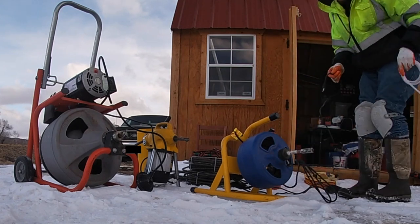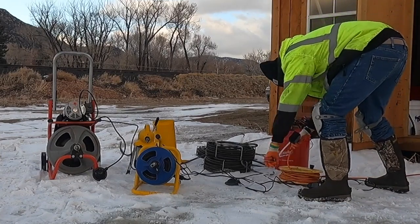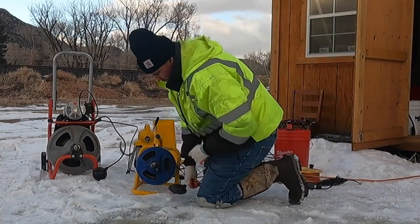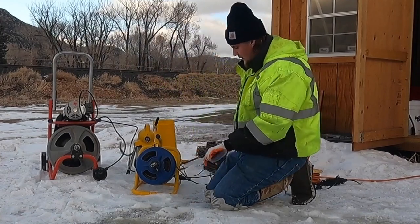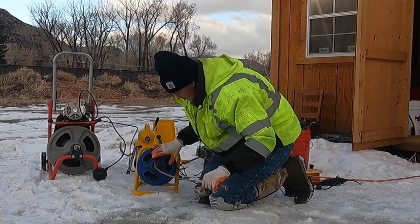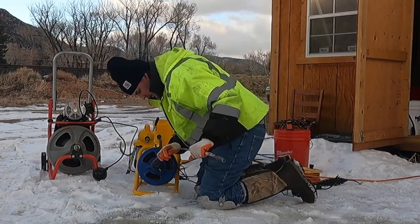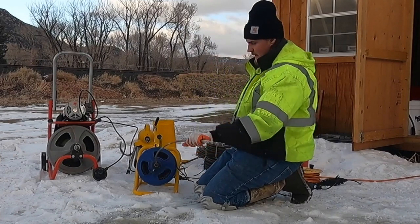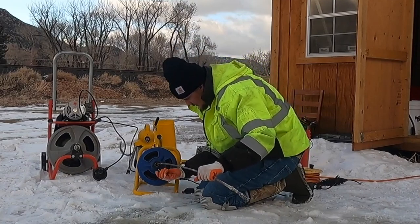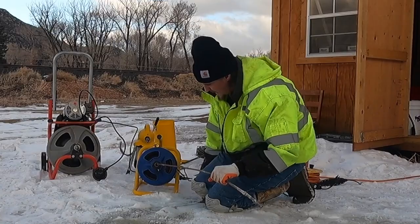This one's done pretty good. It's got a little retriever bit. Plug in the foot pedal first, then plug in the machine. This one is 50 feet of cable, so it's a great kitchen sink machine. There aren't too many kitchen sink lines that this won't work on, and it's also enclosed. This is typically one of the first ones I'll take in to get it draining — then you can go back and jet it out or camera it. Once you get up on something tight it's got this little set screw, but something I don't like about it: I cranked on it and it just kind of strips. It only tightens so much before the plastic just starts spinning.